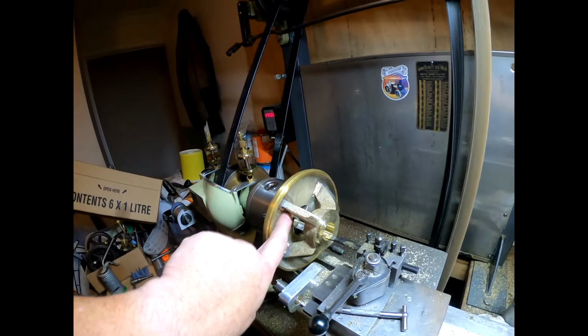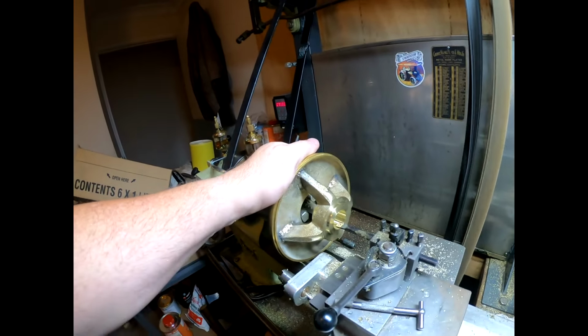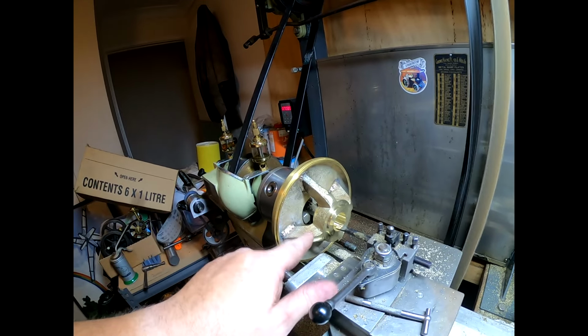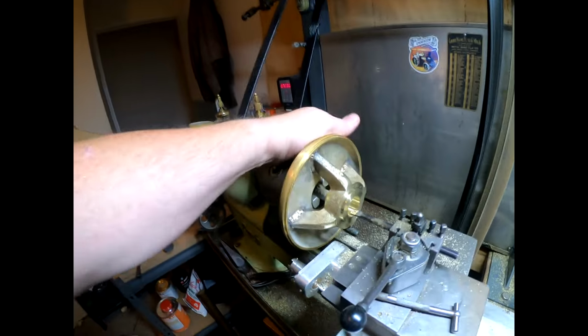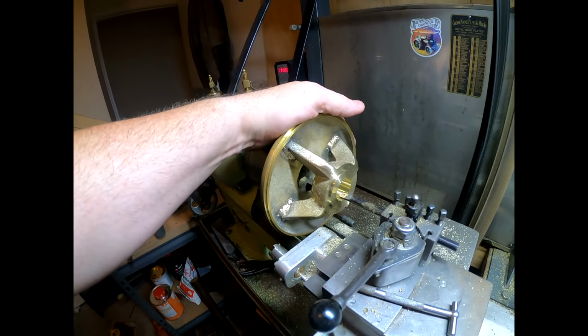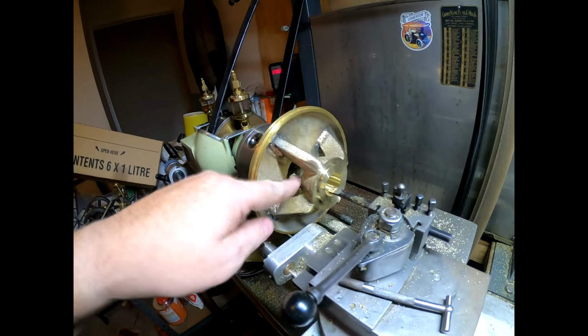Got this set up, tacked on here, or welded on here, or bronzed, or TIG brazed. I think it's probably more welded because these are all the same weld metals, and this is melted pretty substantially to get a fillet in there. I don't think one's melted any more or less than the other, so it's quite solidly welded on here.